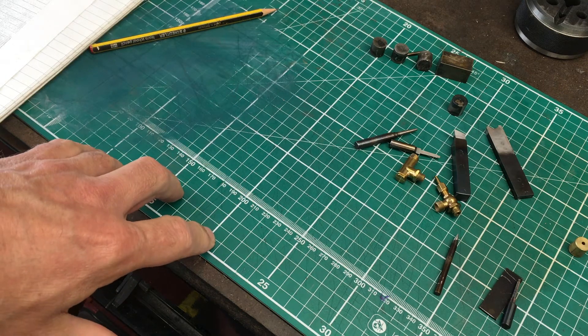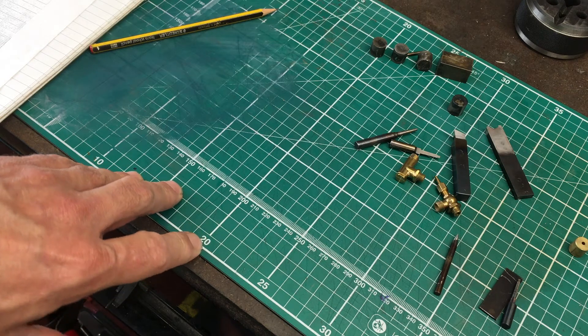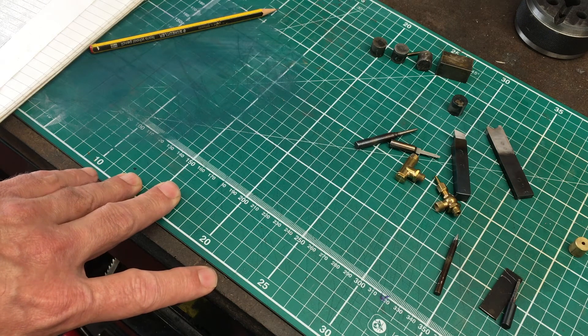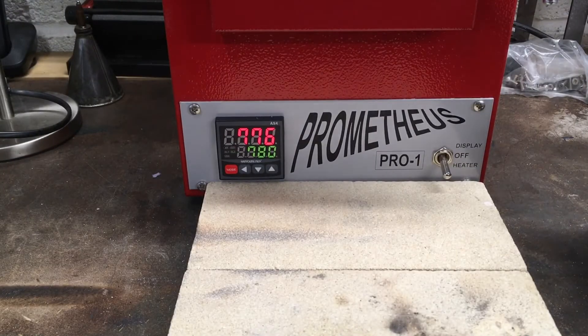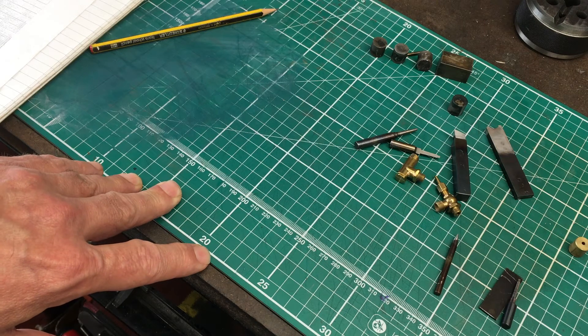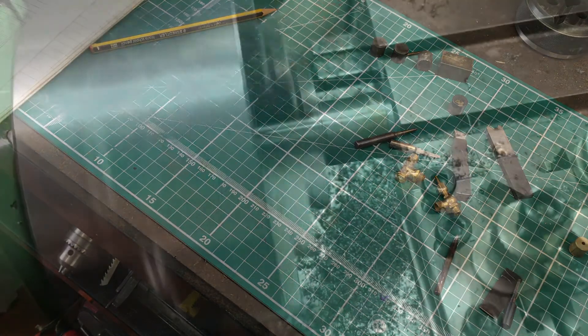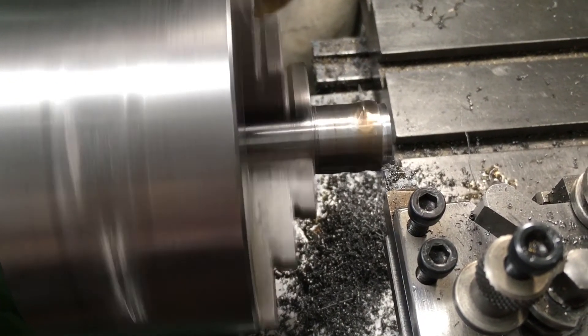The conclusion is that for most purposes you can do pretty much everything with a blowtorch. If you're going to do a lot of hardening, having a kiln is a great idea and probably gives more repeatable results — but it's a bit like changing your golf swing in that it takes a lot of relearning. I was obviously able to get the temperature fairly close by eye, because I didn't have a problem with homemade D-bits, reamers, and form tools. It only became a problem when I started trying to control the temperature more accurately. Anyway, that's it for this one — thanks for watching, don't forget to subscribe, hit the thumbs up if you liked it, and drop me a comment if you want to know more.